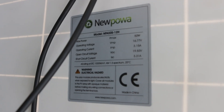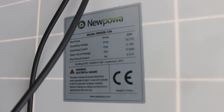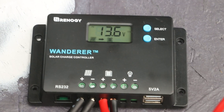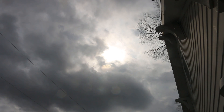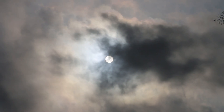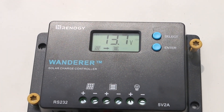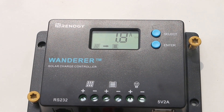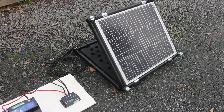It's the next day and I've got a little bit of a brighter sky, not quite sunny yet. This is a 50-watt panel rated for an open circuit voltage of 19.83 volts and about 3.15 amps when it's maxed out. So 13.6 volts of PV — not bad for a cloudy sky. The sun is wanting to peek through and I need to move the panel a little bit — I'm actually out of the sun right now. This is the closest I've had to full sun: 13.7 volts, 1.8 amps. It's cool to see that the amount of sun I'm getting is directly correlated to how much power this can generate.